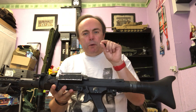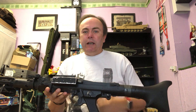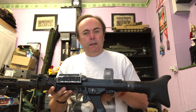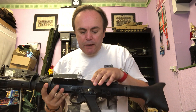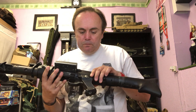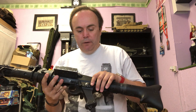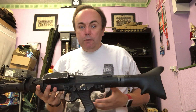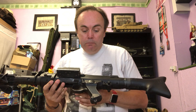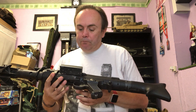Going back to the feed tray box I made from sheet aluminium: I started off using 0.8mm thick sheet aluminium, but the radius on the curves couldn't get sharp enough, so I got 0.4mm sheet aluminium instead, and the radius on the curves at the ends now looks much better. Back to the greebly — you'll find various ideas online about what it was. I went with the one from Sandy Comms on Facebook, and I think it looks right from the pictures. It was spray painted black and weathered the same way.